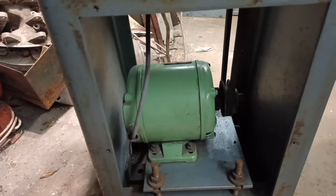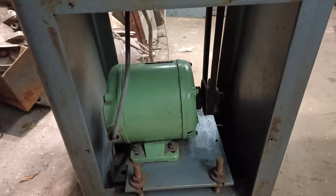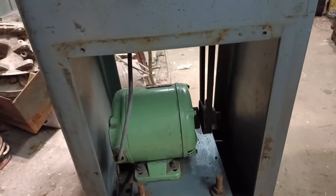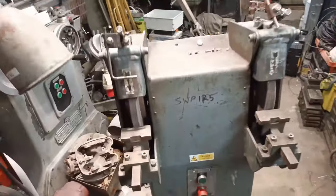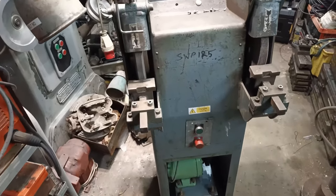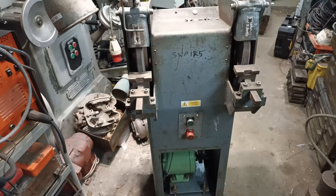It's a 750-watt three-phase motor, dual pole, running at around 2800 RPM. As you can see, it's stood in the middle of the garage; I'm running out of space and I need to get this up and running because it's a handy bit of kit to have.